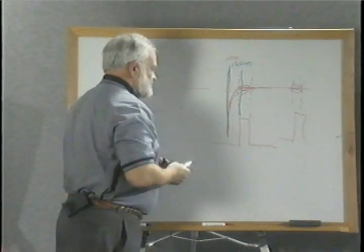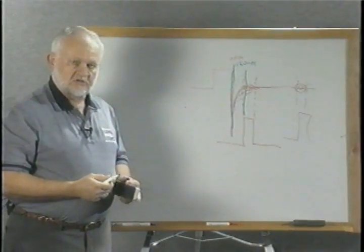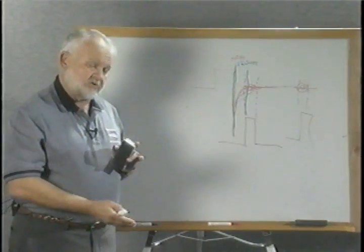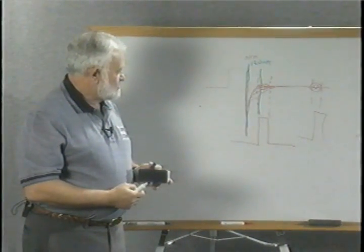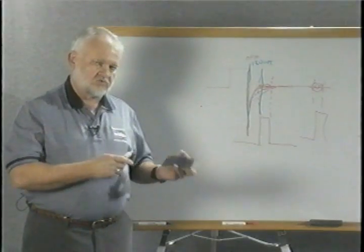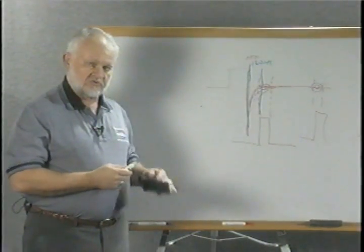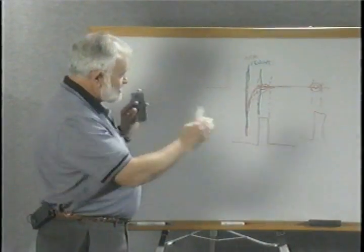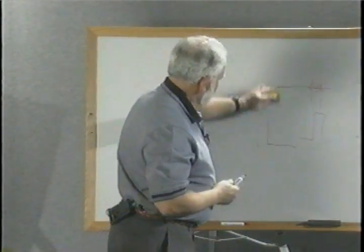What that does is increases the overall sensitivity to very small pieces of jewelry, deeper buried coins, and also gold will show up easier with a shorter delay than it would with the previous model. Now that's just the sampling. We've also increased the overall gain of the system.